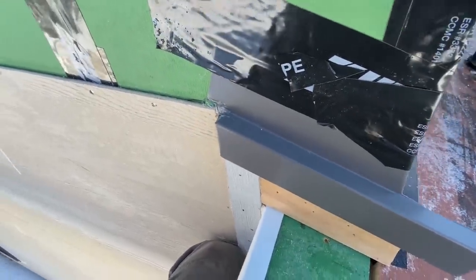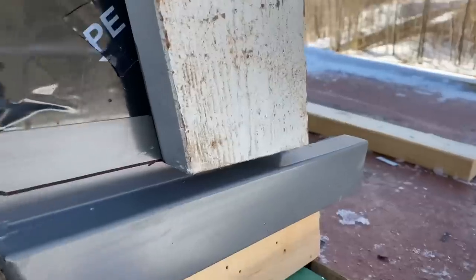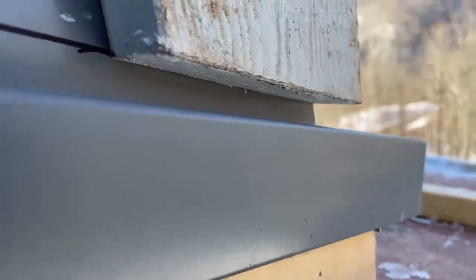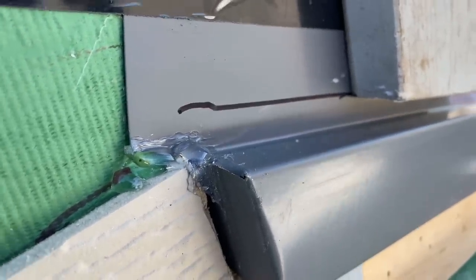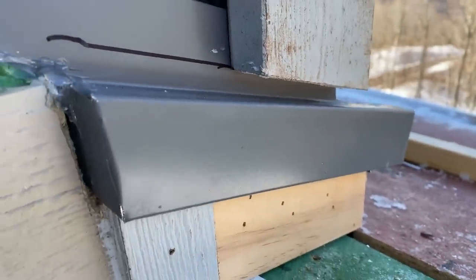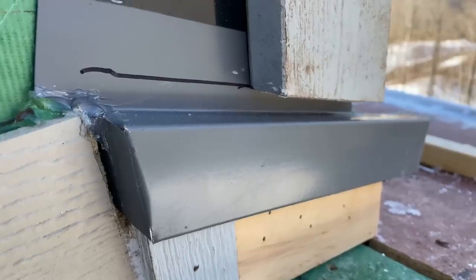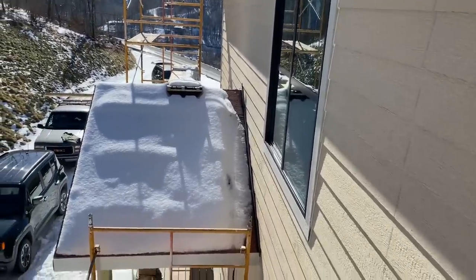Here's a look at the corner before we put the corner board on — it's good to go. I'm going to zip tape that. Corner board is nailed on. You can see I left a gap under the corner board — the bottom is sealed and that pin line there is going to be the bottom of the siding. We don't want the siding material to touch the top of this flashing because then it could get wet and wick water up into the end of the boards, so it's really critical to leave that gap.